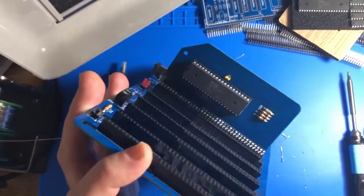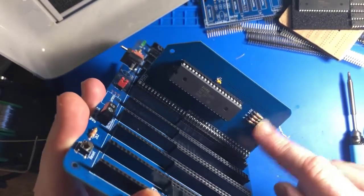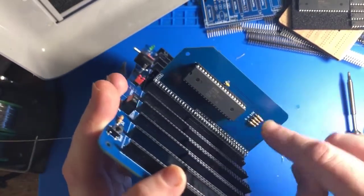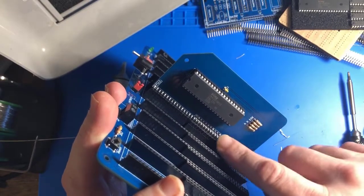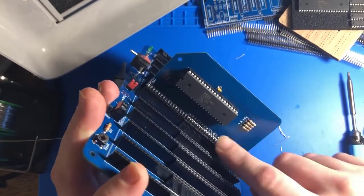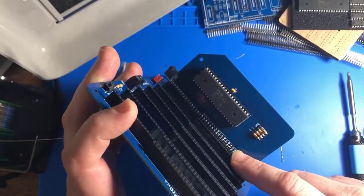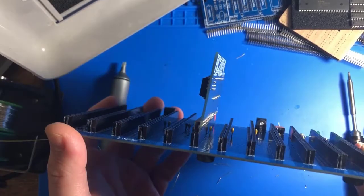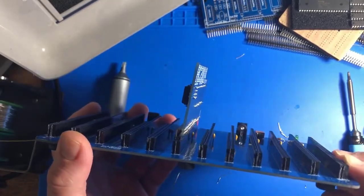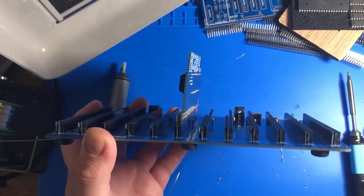You saw me put them in, clip them. They all fell out. So after they were trimmed down to size, I bent them better. And just cut these first, bend them better. Install this and the socket first. In fact, start with the resistors. I should have done those first, and I probably would have ended up with straighter pins as a result if I had. Do these last. So lessons learned, moving on to the next board. I'm gonna do this like the least amount of solder joints to the most and do the most last.